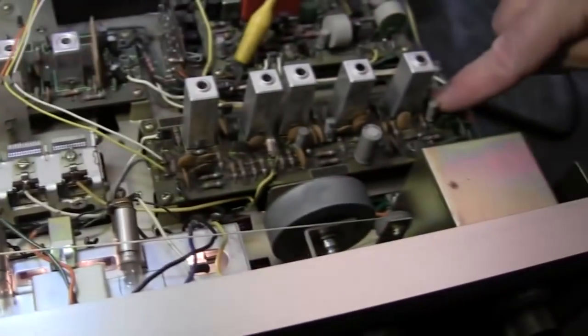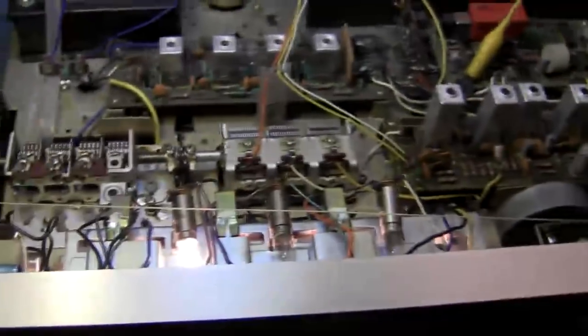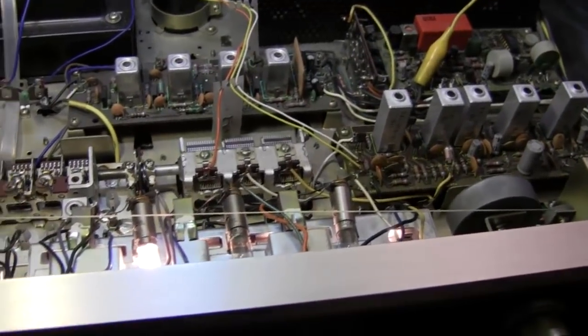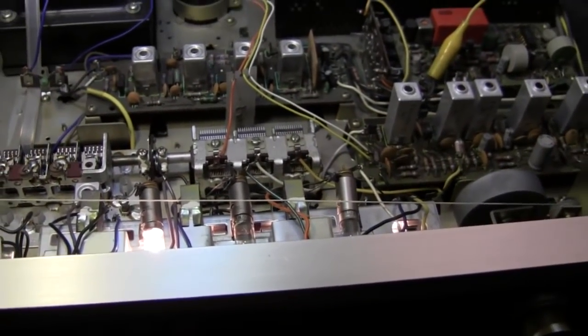So you've got mono FM, mono AM. But you've got wideband mono so you can do the stereo demodulation. And then we've got a stereo decoder board, and whatever this little bugger is, and then your power amp, and your preamps are buried across the front here. This was sometime in the 70s. I've worked on these when these were new.